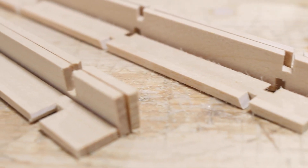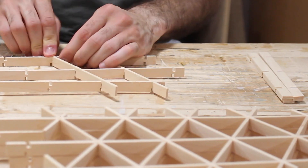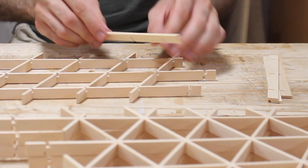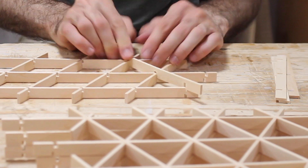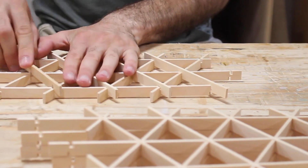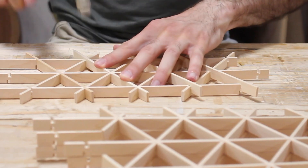For this kind of grid you need two different types of pieces, and once I have them all cut I can start assembling them. Assembly is pretty simple, but the last pieces can get pretty tight sometimes, so I like to put them all in halfway and then tap them in place. This hammer has a soft plastic head on it so it won't dent the wood.